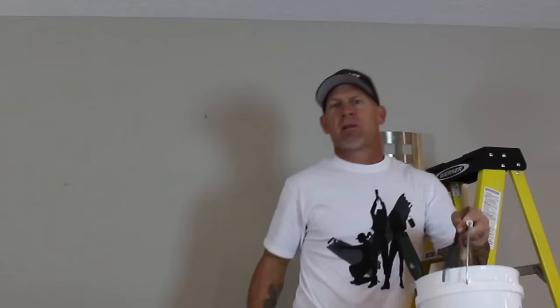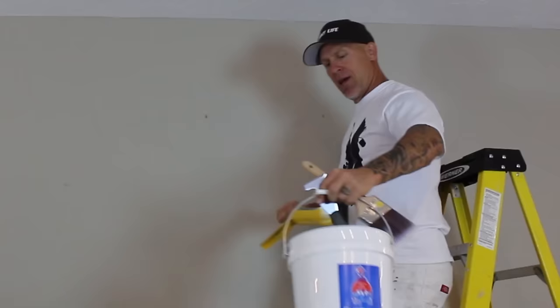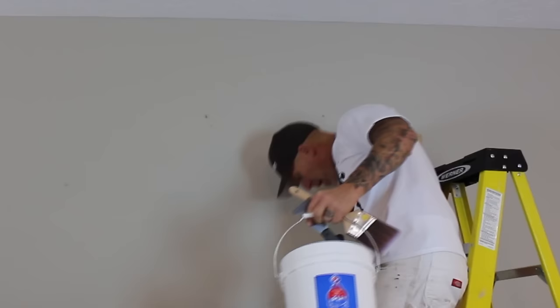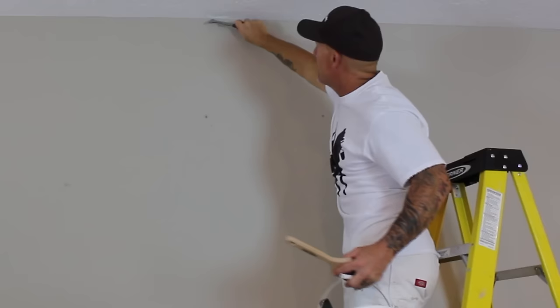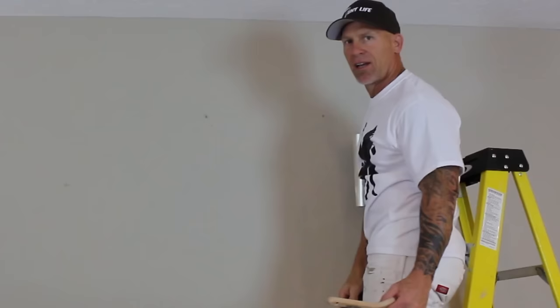I'm going to get up here and show you what scoring looks like and what it looks like to put the caulking on, and then we're going to do some cut-ins. You're obviously going to need a ladder. I've got a six-foot ladder and a caulking gun up here. This is a pretty smooth 90-degree angle, but if it was pretty rough, I'd just take my five-in-one, stick it in here, and just gouge it right there — it leaves a little cut. I'm just going to put a little bit of pressure and score it right down there.